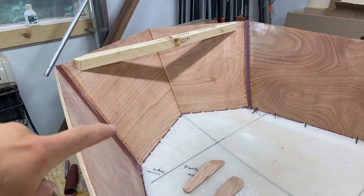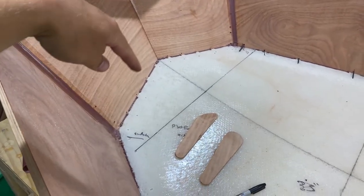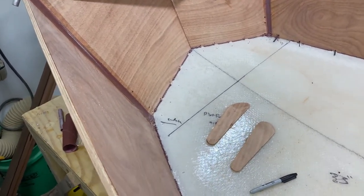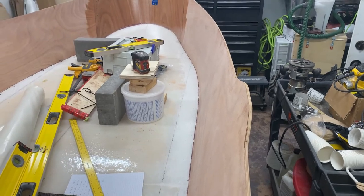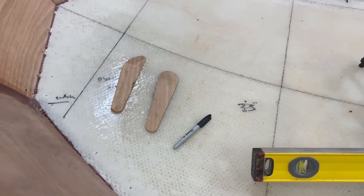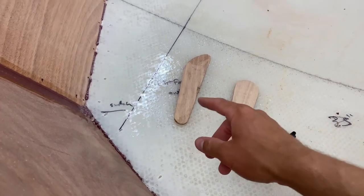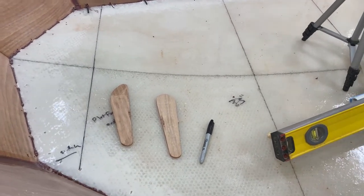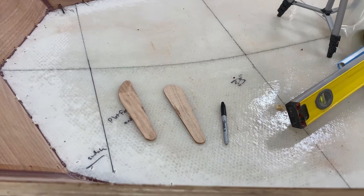It's the next day. These two fillets have cured enough, so I went through and cut all the wire ties and bailing wire on this side of the boat, and sanded all the tack fillets down. We're going to do the filleting work on this side. One good thing to do before you actually start filleting is to go through and check which filleting tools you'll need along the joint, since you're racing against the epoxy curing.